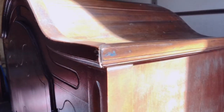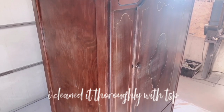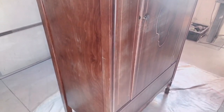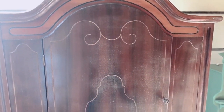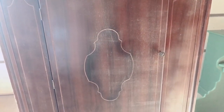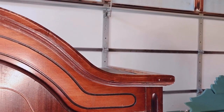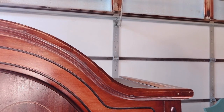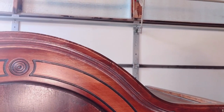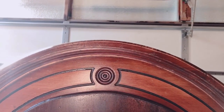To get this piece ready for my first coat of paint I did a little bit of prep work off camera. I had to add a few extra nails to a piece of trim that was coming loose, and I went over the entire piece with some 220 grit sandpaper on my sanding block just to scuff up the shiny original surface. Since my end goal is to have the piece still looking old, I'm not too worried about any dings or nicks in the finish — this will just add to the overall character of the piece.